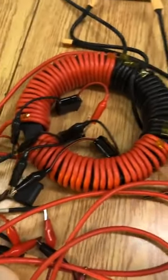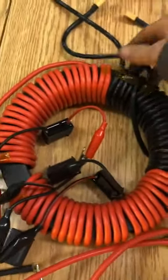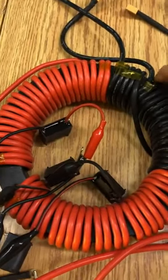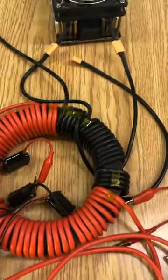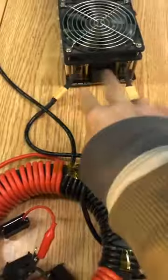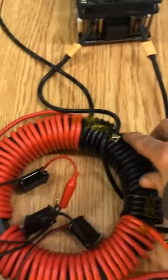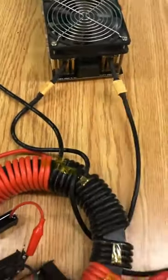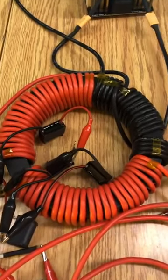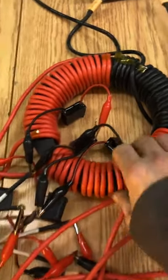What I'm showing you now is I'm making the harmonic resonator, so it's the next step up the ladder so to speak. I'll go through a brief description of the harmonic resonator. We have our fundamental frequency here — this is all LC resonance — so we've got capacitors to switch the fundamental length of wire, we have inductance, we have capacitance. I'm leaving resistance out of the entire equation until the end, and that sets the operating frequency of the harmonizer, which is what this is going to become.